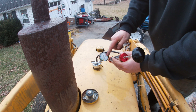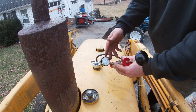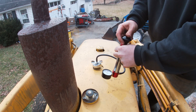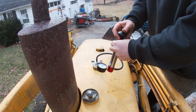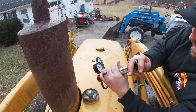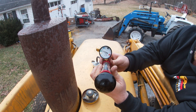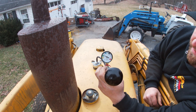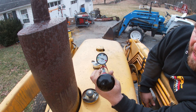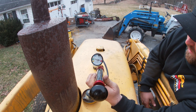What I'm going to do now is manually pump this up. We're going to see this gauge rise and I'm going to go to the green, which is 7 PSI — fairly typical for this tractor — and it should stick within the green. So I went right to the top part of the green there, and you can see it's sitting there. We can let it sit there all day long; it's going to stay right there. That tells us that we have a good, healthy, tight radiator system.